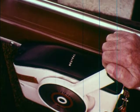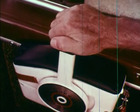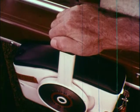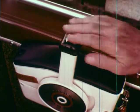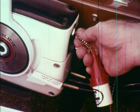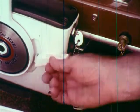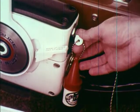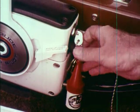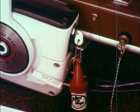But don't back up too fast. The square stern will push water up over the back of the boat. Most controls have an interlock so that the engine will not start except in neutral — straight up. If the boat has been sitting a while and the engine is cold, it may be necessary to use the warm-up lever and the choke. The choke is generally a button or a toggle switch located on the control. Operate the choke while turning the key until the engine starts, then release both the button and the key. They will return automatically to their normal positions. You are now ready to drive the boat.